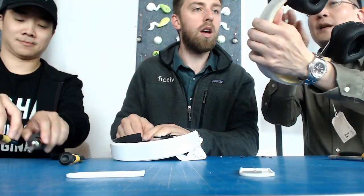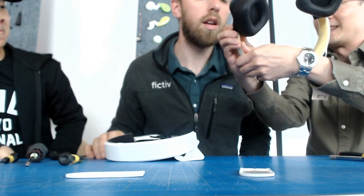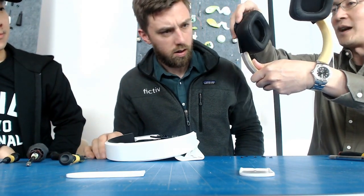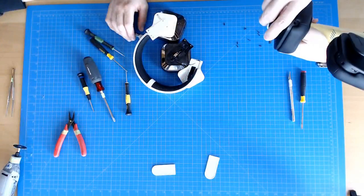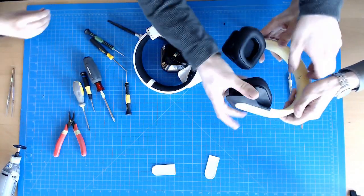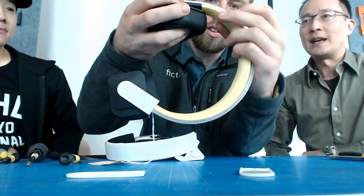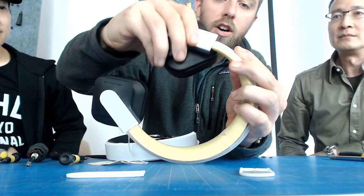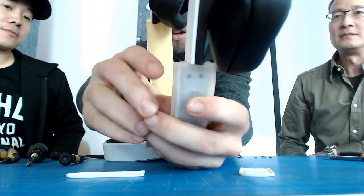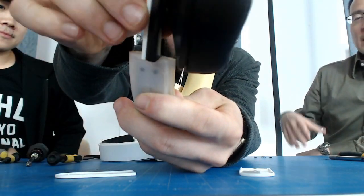We had snaps on the outside. That didn't quite work because of the way it interacted with the part when you're rotating it. It kind of gets stuck on one way. So what he's showing here is a high resolution 3D print. If we turn it, we can see right here that we have almost like a snap fit, a ramp interference fit.